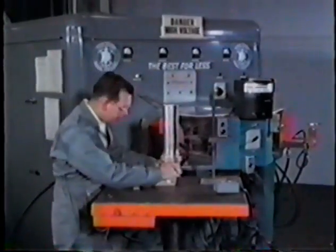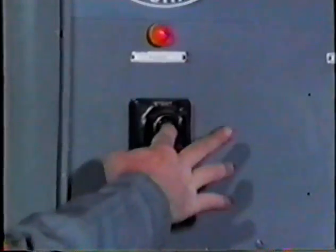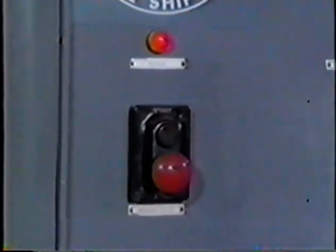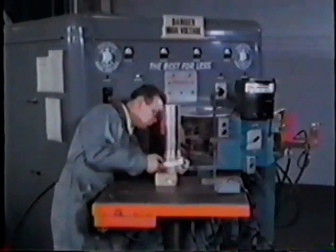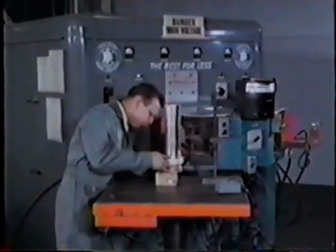At the start of operations, warm up the equipment for 5 to 10 minutes by turning on the filament switch and set to proper filament voltage. Now adjust the work coil. Put 2 of the 3 turns of the coil around the fitting over pipe and fitting lands, since the heavier fitting needs more heat than the pipe.